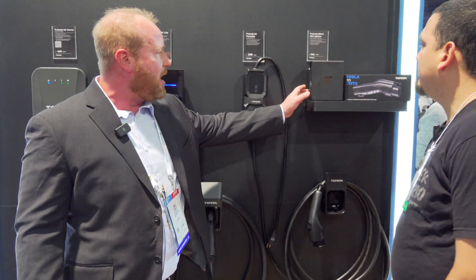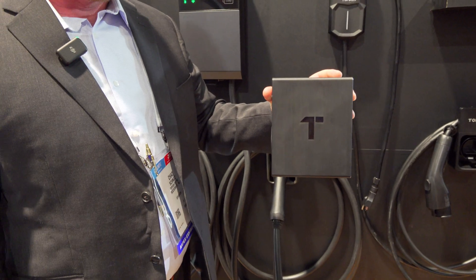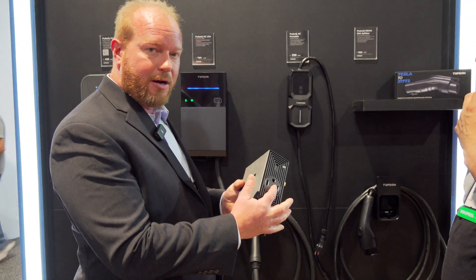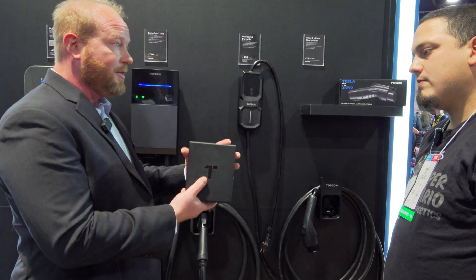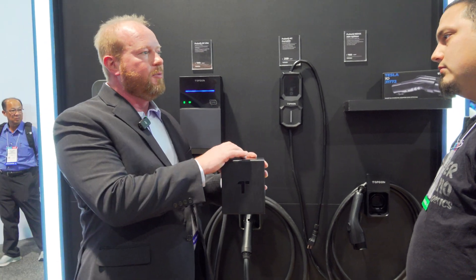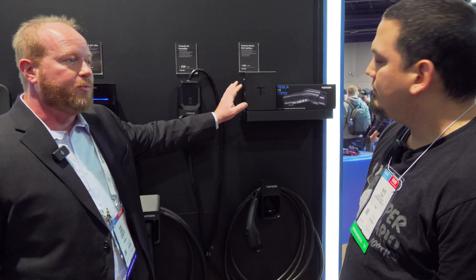So we have come out with this box here — this is a splitter box. This has your NEMA 14-50 plug that would go into the wall, and then it has a plug on both sides. So we can plug this into our dryer outlet or our welder outlet in the garage — there's a primary and a secondary. When the dryer is on or you're running your EV car for charging, it'll go to the primary first. Once that's done charging or done using that power, it'll go to the secondary side. It's not simultaneous. But even if I have two EV cars in my garage, if this side of the EV is only consuming 20 amps, it will divert the other 20 or 30 amps to the other side. So it can do simultaneous — it's smart enough to switch back and forth to consume the complete 30 or 50 amps, depending on which one you get. If the dryer is running, it will stop charging the EV. When the dryer is done, it'll full charge the EV.